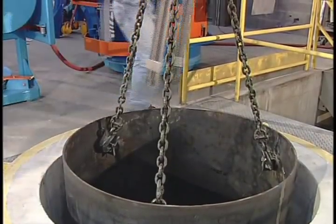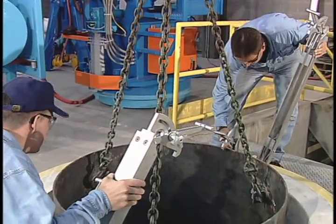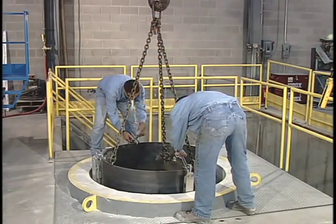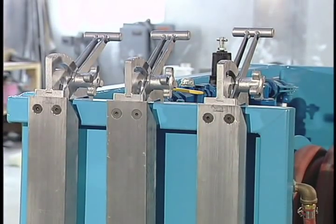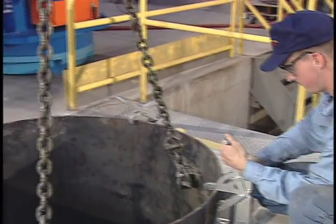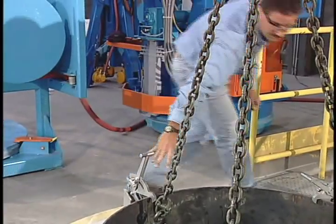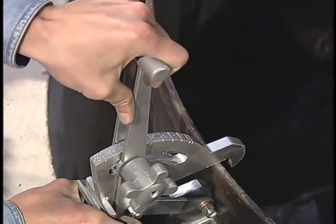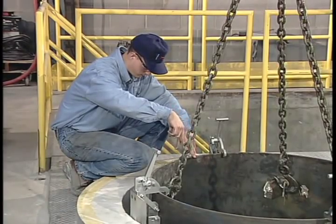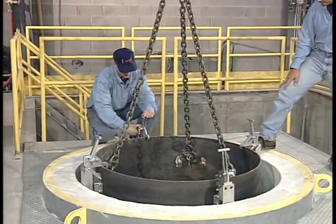Gradmatic has introduced spacing tools to install the form accurately and quickly in just a few minutes. Four insta-centered tools are suspended around the circumference of the form; smaller furnaces use just three tools. Each tool is individually adjusted to obtain uniform spacing between the form and coil using the measuring device on the handle. Once all tools are set at equal spacing, the form is centered for its entire length and lowered to the furnace floor. The tools are then closed and removed.